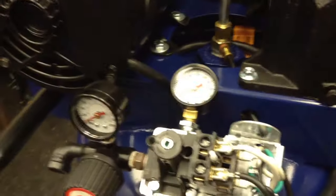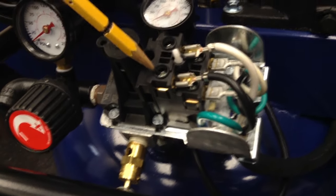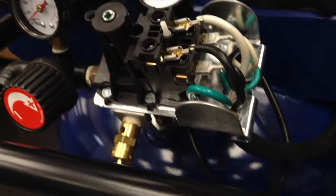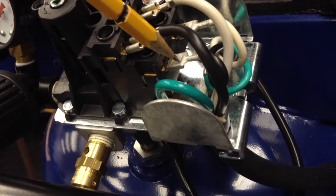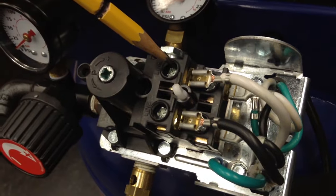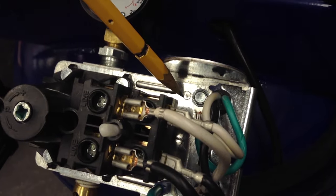Let's look at the fully installed switch again. You have your line wires from your cord coming in — black, with your corresponding black wire from your motor coming in on the same side. Your white wire from your line coming in, white. White wire coming from your motor on the corresponding side, white. Ground to the plate, and ground to the plate from the motor.